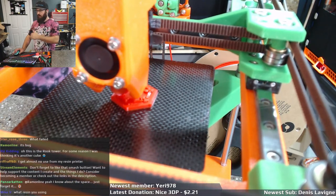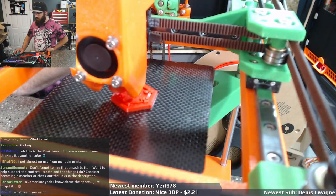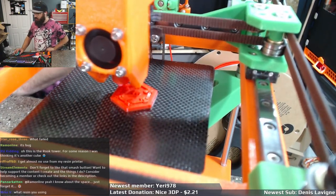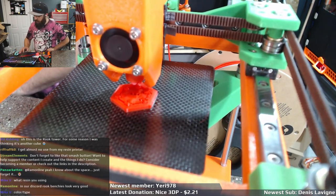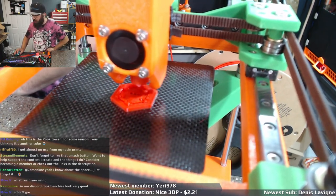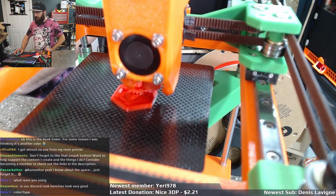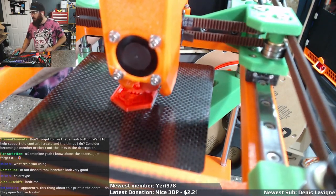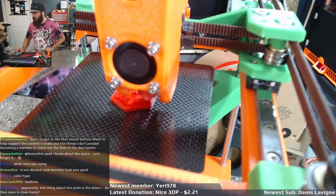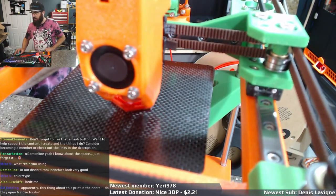Slice. Okay, so lift distance 3, exposure time, I'm gonna do a 4-second exposure. I'm gonna do a nice slow retract, 175. The first layers were good. I'm gonna drop the speed just a little bit because this is gonna finish tonight, and I really don't care when it finishes because I'll be in bed.